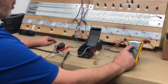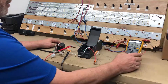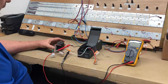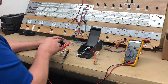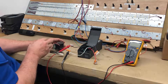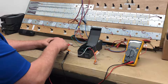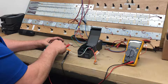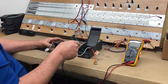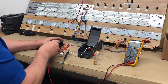As you can see, our voltage reading is low because of a voltage drop on the dimmer, and that's why originally our voltage was a little low on the output. One thing to note: this is a three-way dimmer, so there's an additional red and white wire that would go to another on-off switch — not a dimmer, but an on-off switch in another location in the room. If you don't connect the output of the dimmer to the driver correctly and hook up the wrong wire instead, you will not be able to dim. Make sure you hook up the correct one following the instructions with the dimmer.